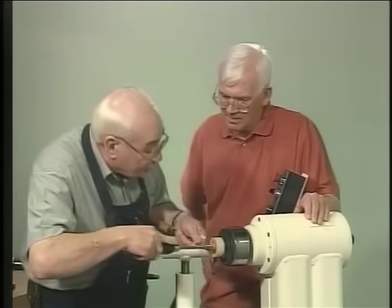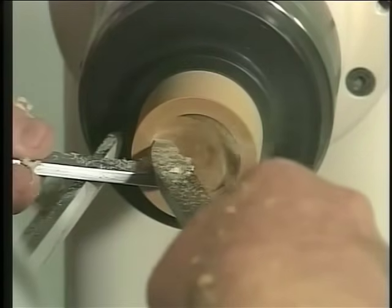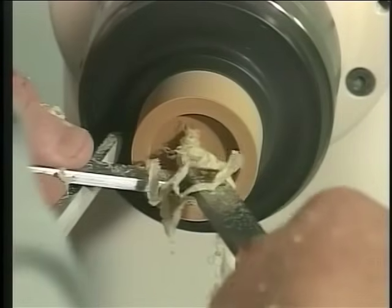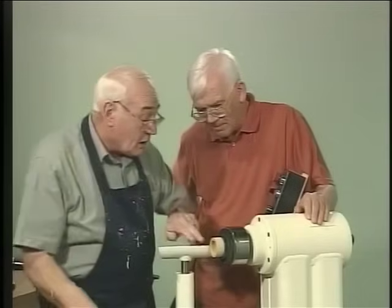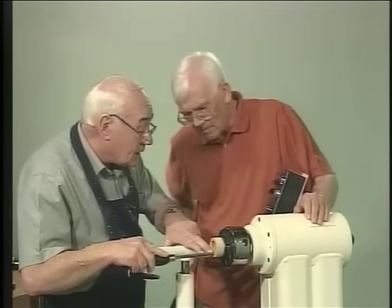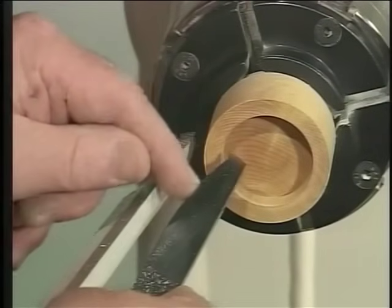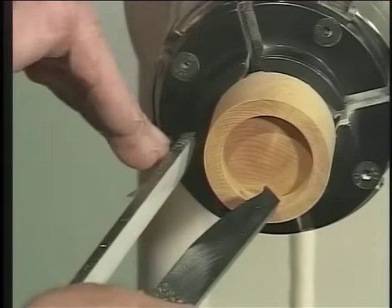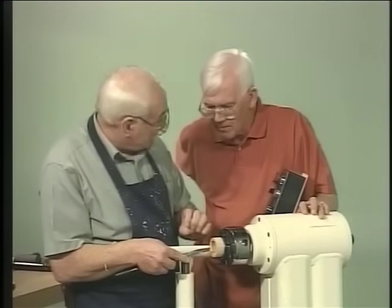Now I'm going to pull the tool across gently, and when I reach the side, I'm going to allow it to cut in to form a groove there. Right. Now, what you'll actually notice with the groove is cut well into the back of the box. You'll notice that's curved inside there, Charles, and that's left a curve at the bottom of that groove. So when the thread is run, it'll actually run through without leaving a sharp edge.